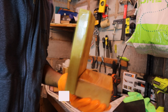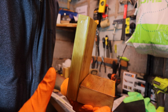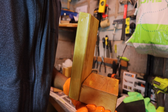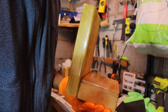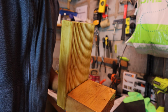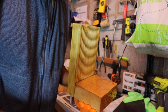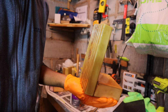Okay, so just like that, the first coat is on. Now it takes up to 12 hours before this is rock solid, and I think you could probably get away with giving it a second coat between 6 to 8 hours. However, sometimes you might even be able to get away with just giving it one coat, depending on the use that you'll be getting out of the particular item. But importantly, between each coat, it's a good idea to give it a light sanding before applying the second coat, to hopefully give you a much smoother finish.